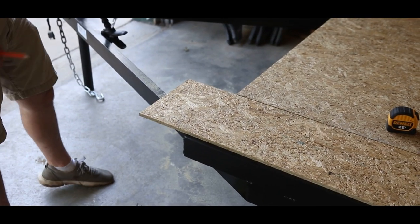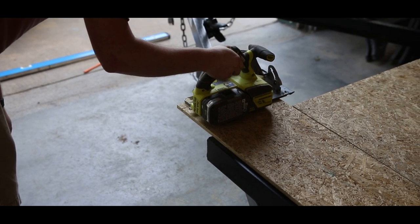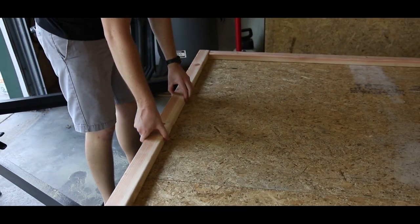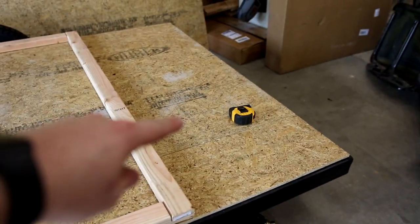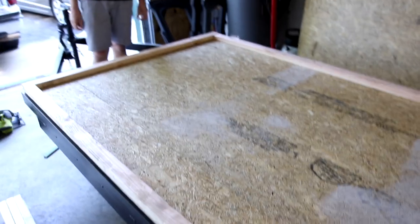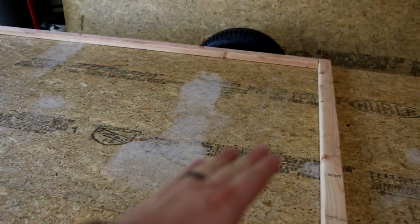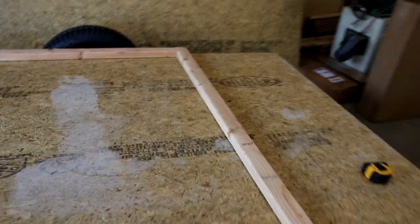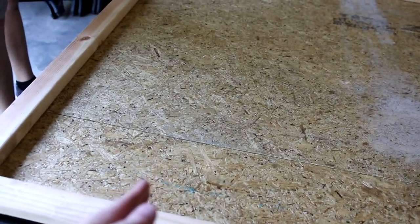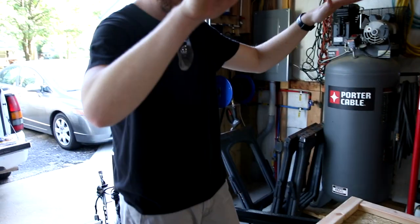Let's build it. This actual frame is eight foot by five foot, so we've got about two foot left here. This space in the back is going to become the kitchen. The reason we're framing this is so that we can insulate in the center with some foam board insulation. Then we'll put a piece of thin plywood over the top to hold the flooring. That will allow the bed to set in there — so it's eight foot, the bed will start here and there will be like 16 inches of front floor space. Cabinets up here above the floor space.